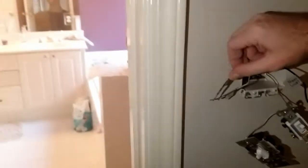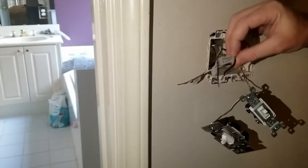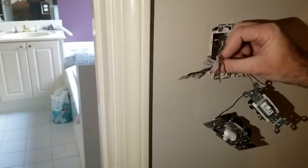and labeled the wires. And the way I labeled them, this is live right now, and I just touched the wires. So yeah, you could get shocked. You're not gonna get electrocuted doing this. You see, that turns on those lights. And I could tell that these weren't source power, because if they touch, nothing happens. And then this one to that one turns on the shower light. So I know that's the shower light, and this is the source power.